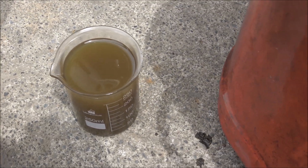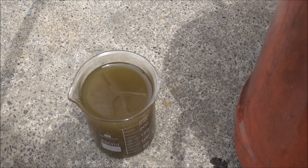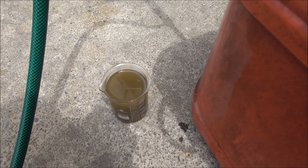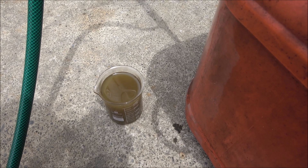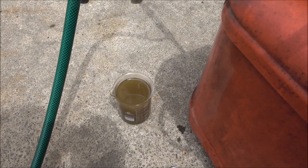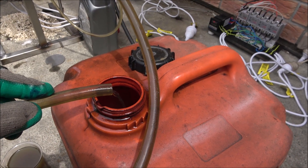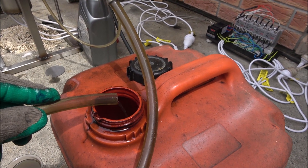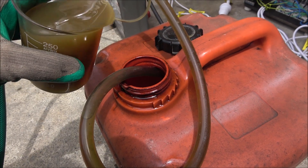As you can see, the output is yellowish but not transparent — it definitely contains some sort of haze or particles. It still needs to be cleaned. There's no way it can be put directly into a fuel tank because it would oxidize and clog all the fuel system lines, intake valves, injectors. It's just a semi-product that still needs to be treated. The machine is new and may start producing clearer oil as it cleans up internally — there could be a lot of dirt and paste within the unit that's just been built, cleaned up by the vapors.